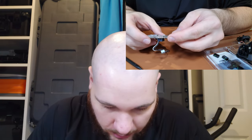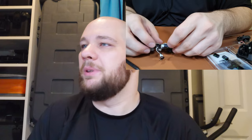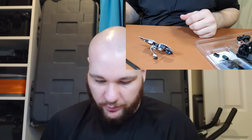Okay. Now, soldering. Place the tip of the soldering iron onto the micro switch contact pins. Work around the micro switch pins while pinning the switch with an opening pick. Then, once that's off, remove and replace the micro switch. Solder all three micro switch pins with soldering iron. Ensure the micro switch is bonded by performing a tug test. And then put it back together by going in reverse.